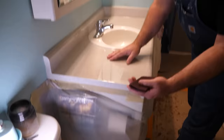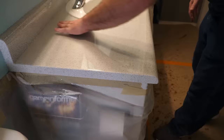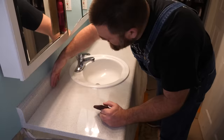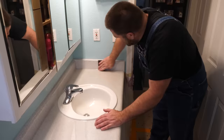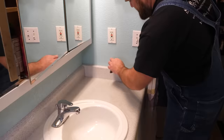We're back — it's past 24 hours, so I'm going to need to lightly scuff up the epoxy before the ultimate top coat. If the epoxy were still subtly tacky, still slightly open, you could do the top coat without sanding. But we're fully dried and cured up, so I'm going to lightly sand. For the edges and this small top, I'm just going to go with this maroon Scotch-Brite sanding pad — you don't need much, it just creates a mechanical bond for the top coat. My vertical sides are nice and smooth with no ridges, so I don't need the random orbital — I'll just scuff them up.